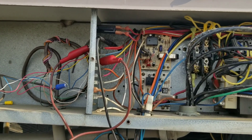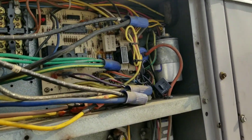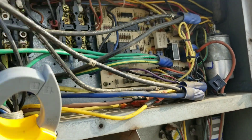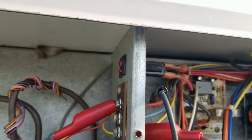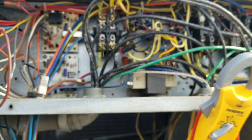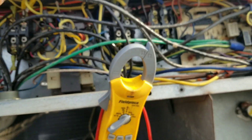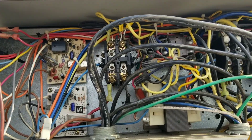Well, I didn't really get the results I was expecting from that test. I'm in stage 2 cooling right now and my little popper over there didn't pop — the popper over here is fine too. So whatever we have going on, I'll bet we have maybe a slight little rub-out that's just barely touching something. Let me get in there a little bit closer and inspect some of this wiring.